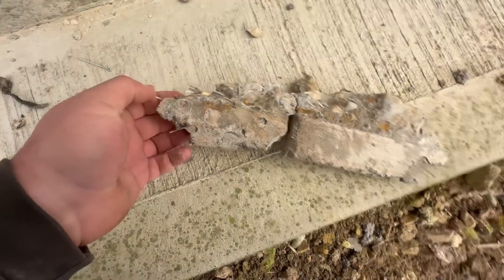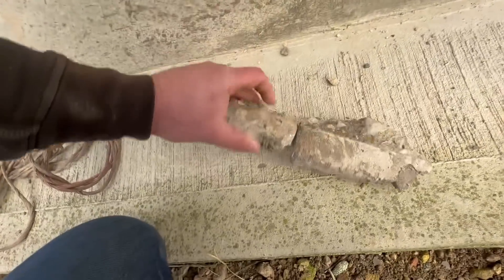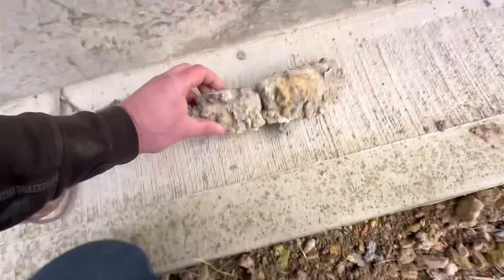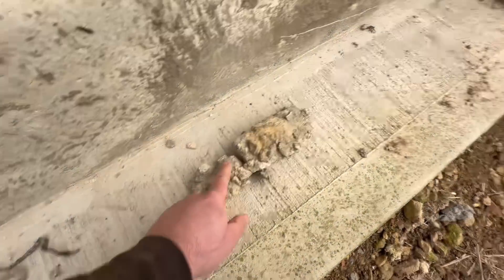I've got a few people asking why I'm not putting mesh in the concrete. I don't think I really need to here - we're on solid bedrock. It takes some digging out as it is; you have to jackhammer through it. I'll show you what these structural fibers are all about, because you can get different types. Usually the fibers you order are like fur, whereas these structural fibers are like razor blades. I've got a little piece of set concrete here so you can see what they look like. Can you see all these? They make it solid - they're all the way through the concrete. That bit's actually broken and the fibers are holding it together, doing the same job as steel but for half the price. There's only one fiber holding that together - just shows you how strong one fiber can be. Imagine hundreds of thousands of these throughout all this concrete.